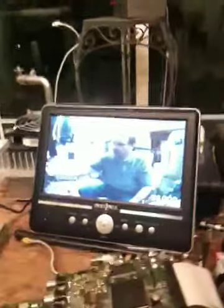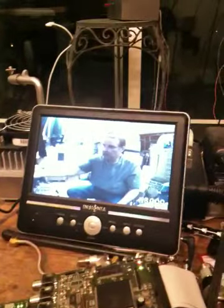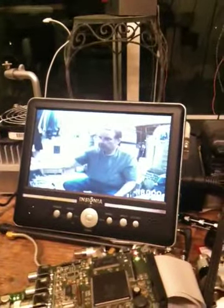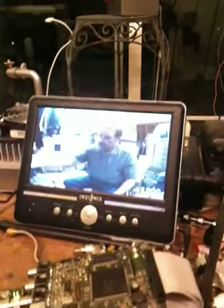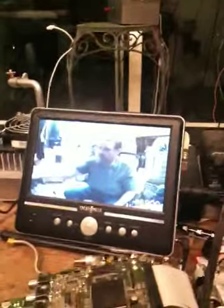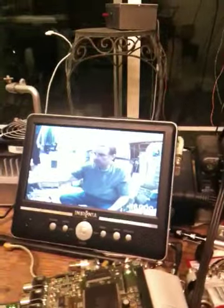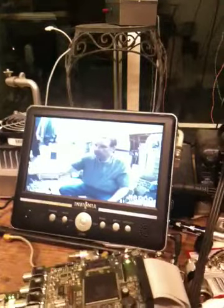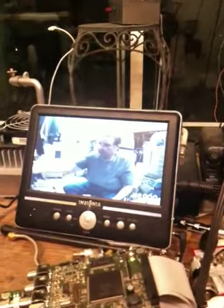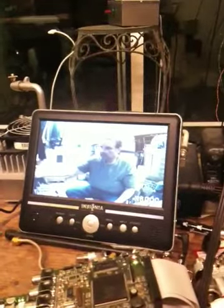The picture you're actually looking at on the TV is coming from an analog camera that is being turned into an MPEG transport stream, modulated at 1.2 gigahertz with DVB-S, then amplified to 4 watts, transmitted from a beam on the roof pointed up towards Sierra Road — about 80-90 watts of effective radiated power.